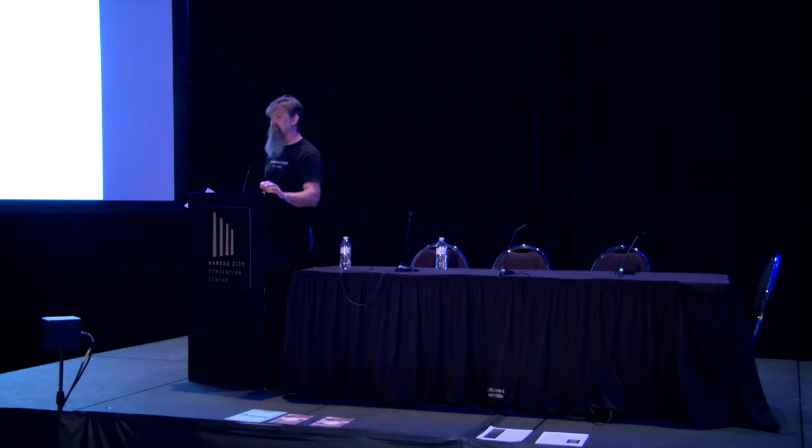In general speaking, and I hate giving this answer because it's kind of a non-answer, but if I'm doing cone 6, I look at right around 75 firings, I start looking. That does not mean you're dead at 75. That means I start looking because, let's face it, you're going to end up with, I need a show tomorrow. My kiln's down. I should have changed the elements. Keep a kiln log and you'll know how many firings you have. Some of the new computers will actually keep that number for you. Read your manuals, they'll tell you, or call your friendly local kiln technician, and we'll tell you how to find that information and if your kiln has it. But yeah, I would start at 75 on that.